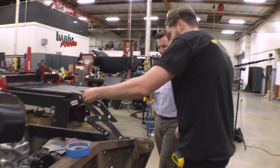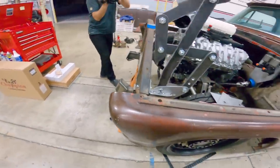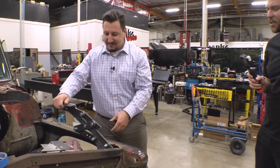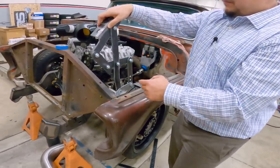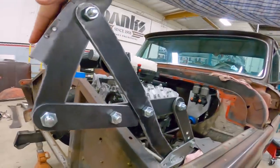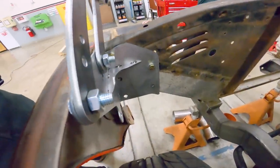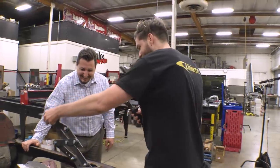That is awesome, so rad. That hard stuff worked perfectly. We talked about keeping the links from going over center — this stuff is all just loose right now, no bearings, not even washers. It's thrown together; I was too excited. To keep this link from going over center, I use the geometry and just let it lock itself into place, so it's got a built-in stop. I'm glad we added those extra bolts — it's all hand tight right now, but we've got some spots and we used two of the factory holes.